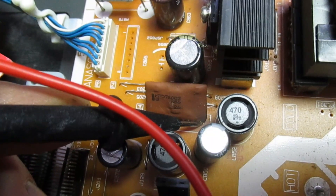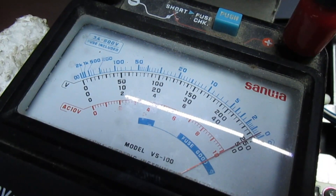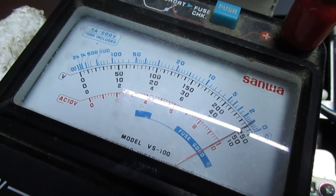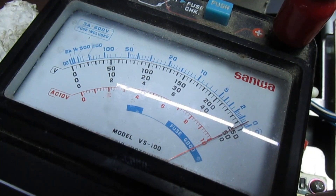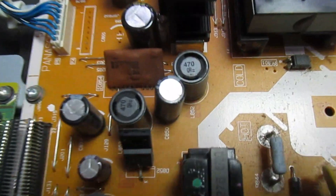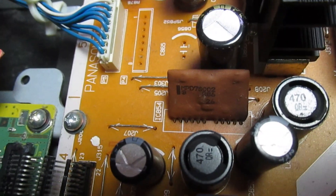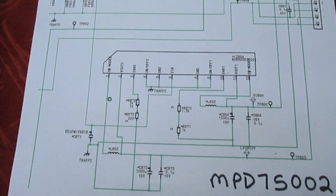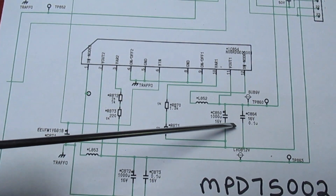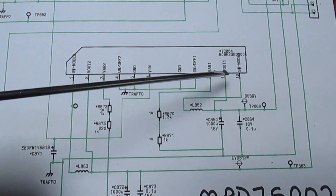That's the chip in question. I've got a meter probe on pin 9 and we've got almost a dead short to ground there. We're going to take this board out, remove a couple of the capacitors on the output, and then see what the problem is — whether it's the capacitors or the chip. I've checked these two capacitors and they're not faulty; they're okay.